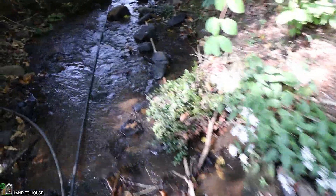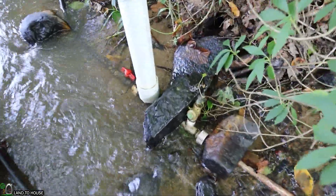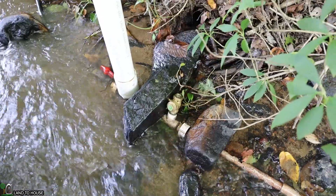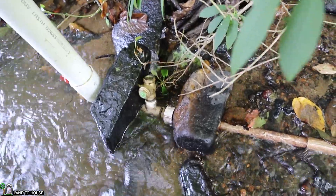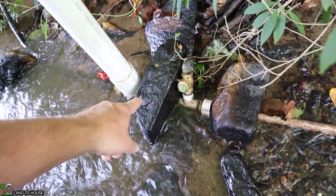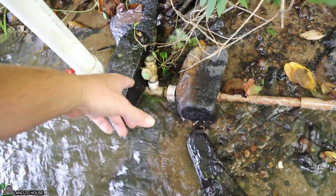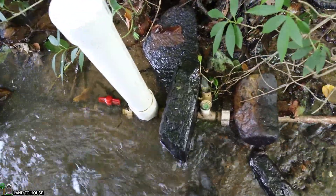From there the drive pipe comes down as rigid PVC, which is important to maintain the pressure wave. The pump is locked down under some rocks and has been cycling for over a month — about once a second. Water comes down the drive pipe and forcibly closes the waste valve. When that valve slams closed, it sends a pressure wave back up the pipe, builds pressure in the pressure tank, and sends water uphill. Once the pressure dissipates, the valve hangs open again and is ready to cycle, as long as there is water coming to the pump.